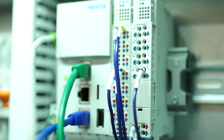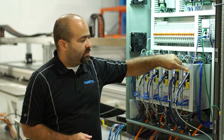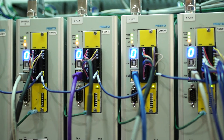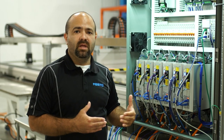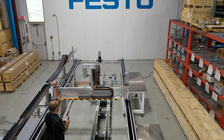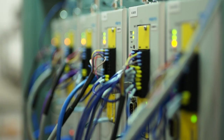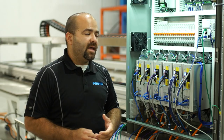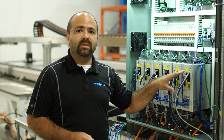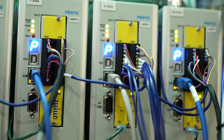In terms of safety and security inside the gantry, we have dedicated cards. This is called an S3 safe speed card. What it does is control the speed inside the gantry in a safe way, so the operator can interact directly with the gantry at safe speed, similar to six-axis robots on the market. That also allows us to do teaching or manually jogging inside the safety area. This is unique in the market — it is a certified card that can only be programmed by a certified technician and is stamped with their signature for tracking purposes.